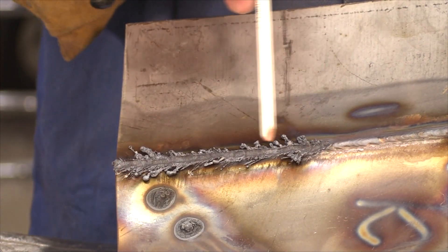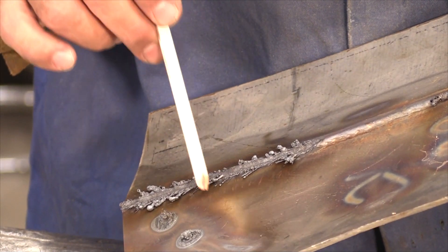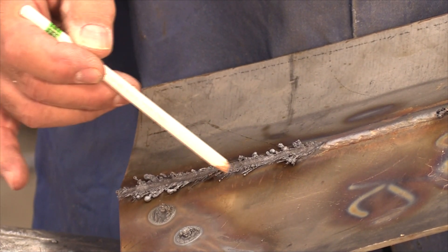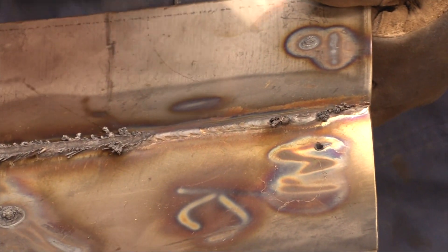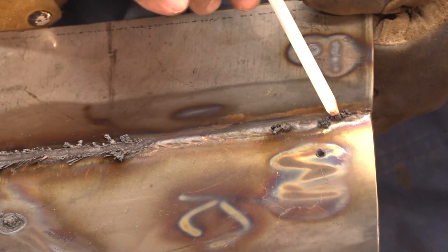I started here and worked my way down. You can see I just about blew right through the whole bead and got down to the base metal. I don't think I quite penetrated the base metal itself, but I got the bead off the top of it. So let's jump over here — I'll turn it up to 30 amps and run this side at 30 amps so we can see the difference.